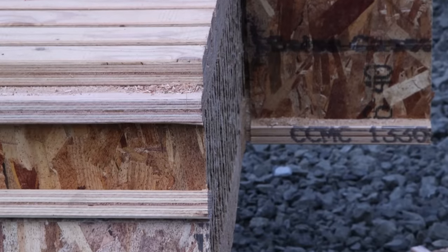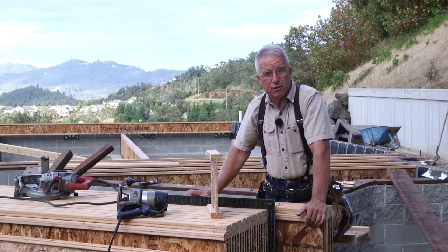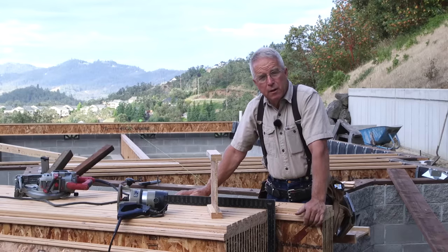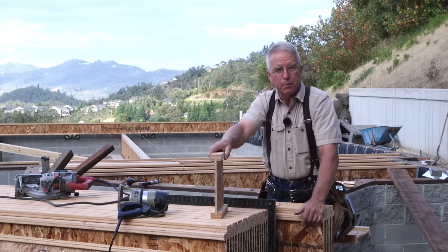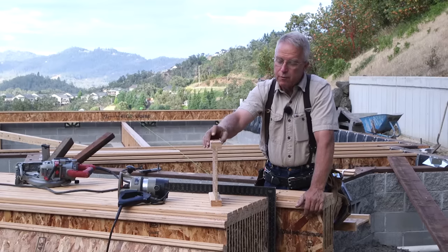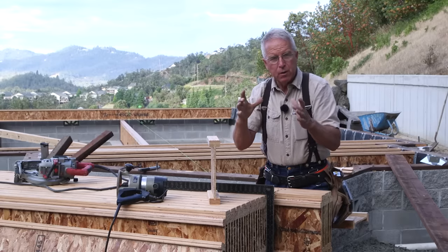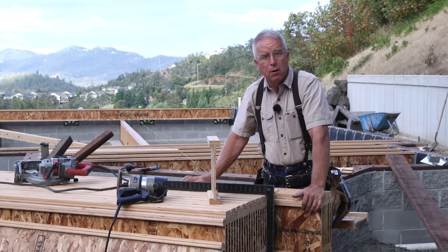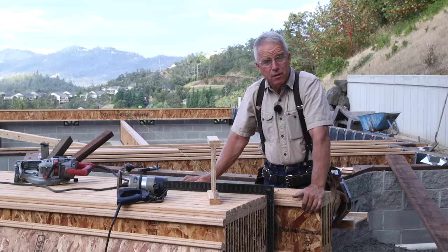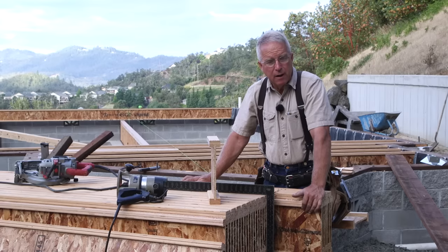Engineered wood products have another environmental and sustainability advantage, and that is that you can make a big joist, or in other applications, beams or sheets of plywood, out of small timber. I think this OSB is made out of aspen, little scrubby aspen trees, primarily up in Canada and in northern latitudes. And these top and bottom chords are made out of little second growth Douglas fir from around here. So now you can take the small end of the timber scale, not the old growth characteristic wood, and turn it into joists that in years past could have only been taken out of big old growth, sort of iconic trees, which still exist and still need to be harvested responsibly. But in the meantime, it has certainly increased the sustainability and versatility of the timber that grows so prolifically here in the Pacific Northwest.